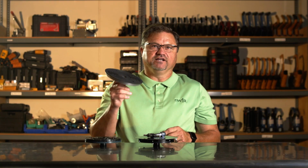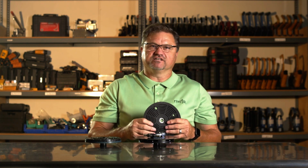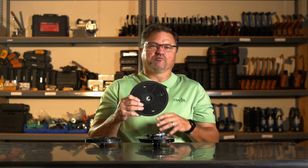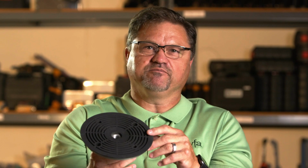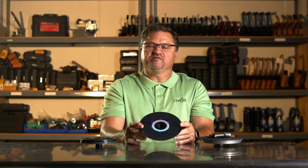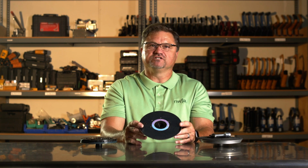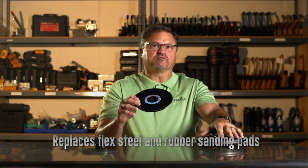Let's go back a little bit in history. When the edgers were developed 65, 70 years ago, every unit, no matter what brand it was, had a rubber pad. The negative to the rubber pad is if you hit a nail or a staple, it's done. I got an opportunity to meet Jason here at the NWFA. He developed the Vector Pro Series. This is a combination of the flex pad and the traditional rubber pad.